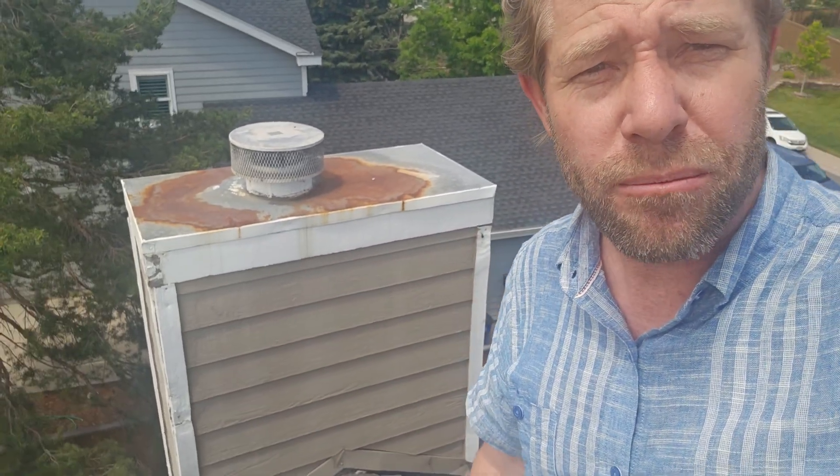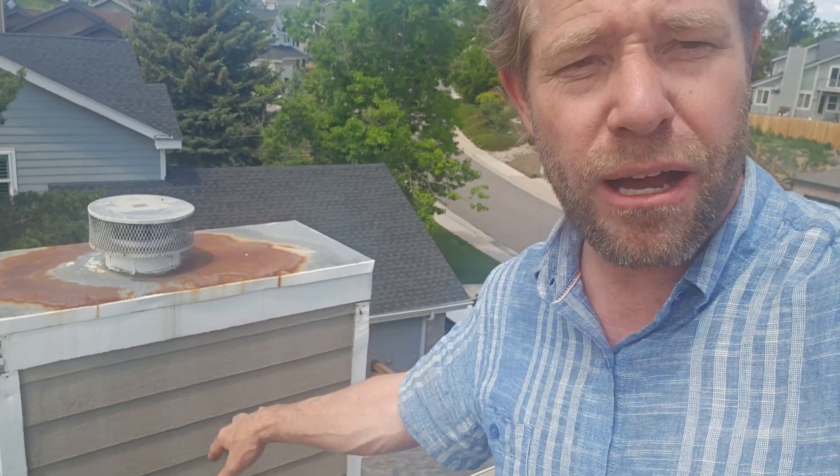You might be saying, Byron, tell me how to fix this thing. I would get a new chase cover, and with that chase cover I'd make sure that we get a storm collar appropriate so that the water sheds onto the actual chase pan or chase cover. Then I would go ahead and have a handyman, general contractor, or maybe your chimney sweep company will do this, but replace the boards — at least the top 10 feet all the way around, all four sides. Get a fresh start. Use real wood that has wood grain to it, not a press board, then paint it and give them a fresh start. It'll be a scaffolding job. Just wanted to share that with you today — it took me a couple minutes to find it, but I think you guys probably would have found it right away by going up and just pushing on the top. Here's to you and your success.